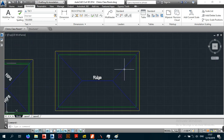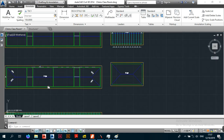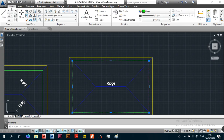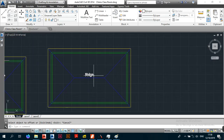What we're going to be doing today is this simple hip roof. I decided let's just do the simplest, smallest one and get this done as quickly as possible. Like the previous video, I'm going to select this and offset it by 230 so we have 230 eaves for a clear representation of the roof. This is the ridge, and these lines going at 45 degrees are the hips.